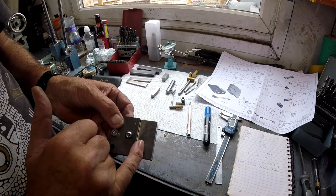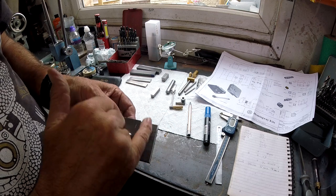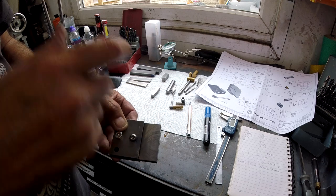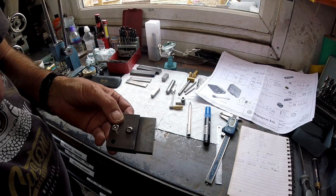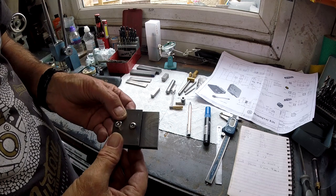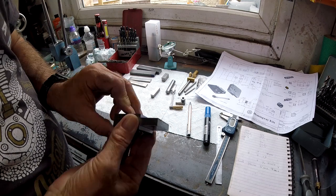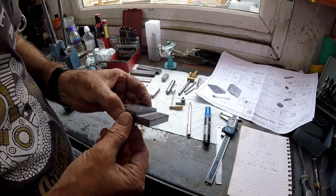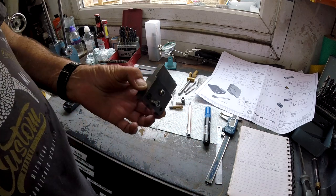And then that side, which doesn't look very nice at all, was done with a face cutter. I do suspect the bits were blunt on that. There must have been, because it normally finishes like chrome. So that's been deburred, but this side just needs touching up all the way around. So that's as far as we've got.